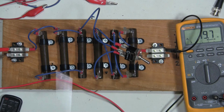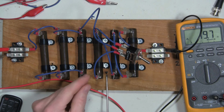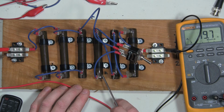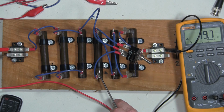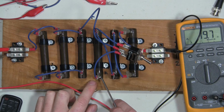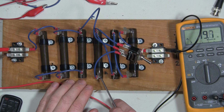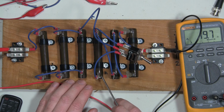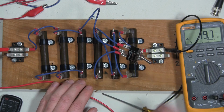Oh, did you see that? And I think this is part of the flaw in this design. Part of the ceramic part broke off, or whatever this coating is. I don't know if this coating's ceramic or not, and exposed this part of the conductor. Now, overall, we're talking about 10 ohms, and this getting contaminated right here will probably not be that big of a deal, considering the amount of surface area that this has and the conductor is. Probably not going to add to the resistor that much, but I think that's a flaw in the design,